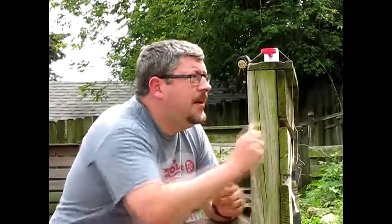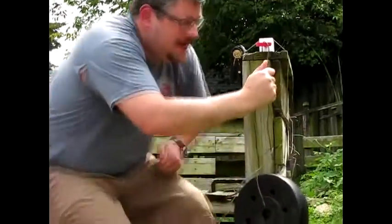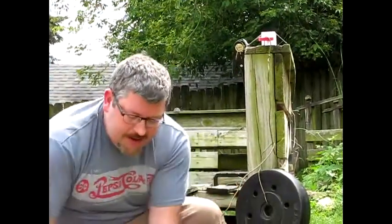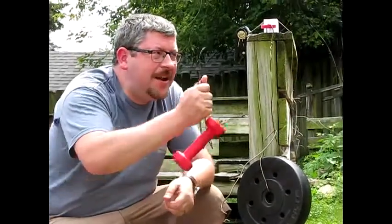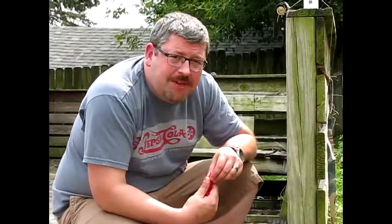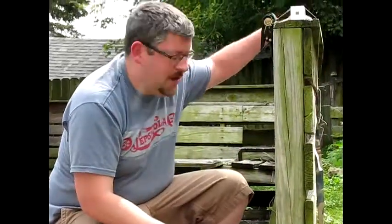Let me get the 10-pound rig and see how that works. Hanging the same 10 pounds we used on the last one — this one does hold 10 pounds. Let's add another 3 pounds and see what happens. We're going to go slow this time because last time we got some unexpected results. It will not hold the extra 3 pounds. This one is still not as strong as the original cheap USA filament PLA, which I got for $10 a roll — you can find that in my budget filament series. This stuff costs considerably more than $10 a roll.